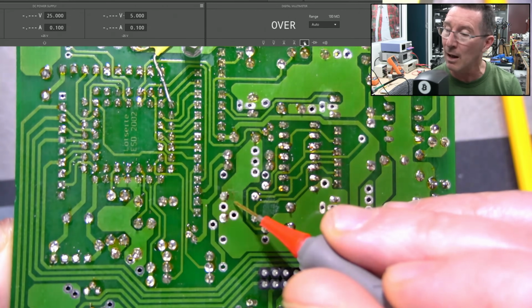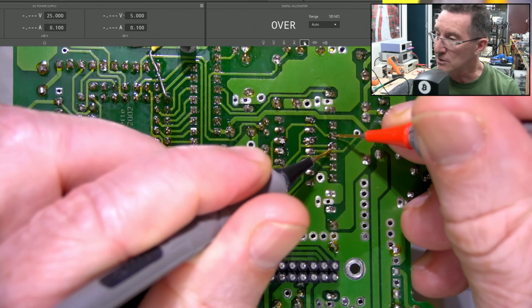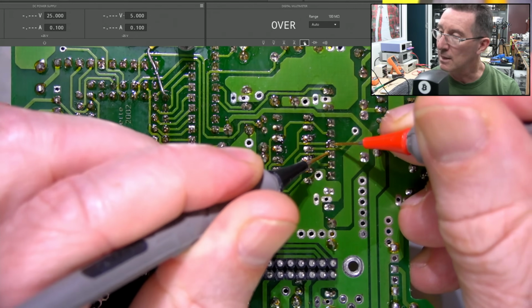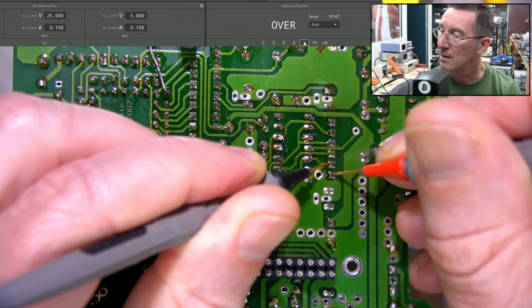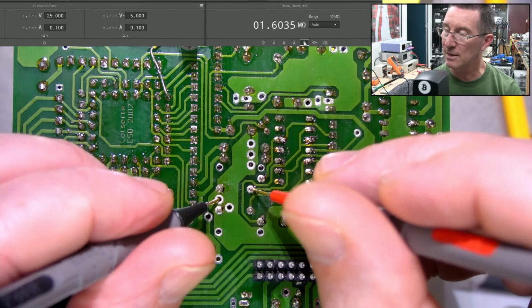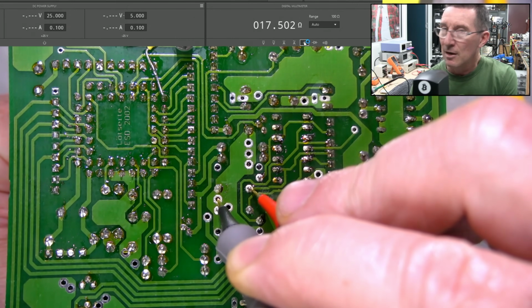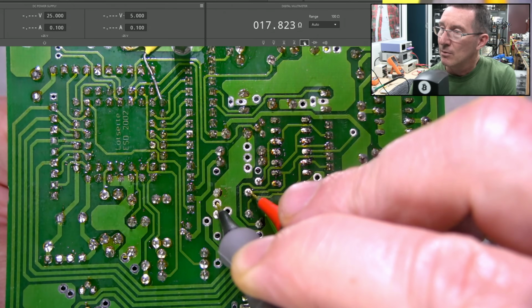In this case, it'd be a pull up because it looks like presumably this is ground here, given the flood fill. This resistor across here, we're talking 20k. Okay, is that a common jobby? Usually they have 10k. So what we can do now is measure between ground and here. I'm reaching under here, I've got it mounted above. Oh, 18 ohms, there you go, so that's grounded.